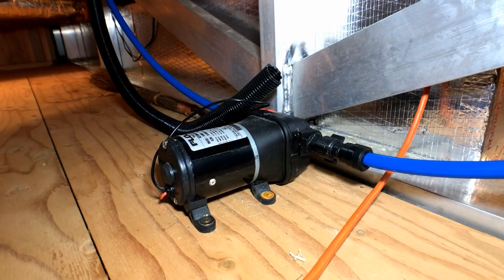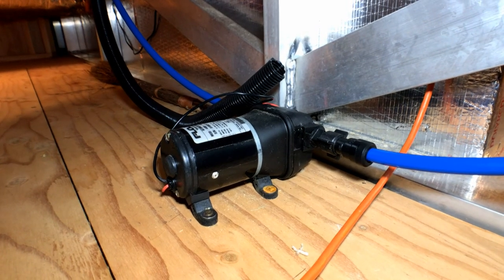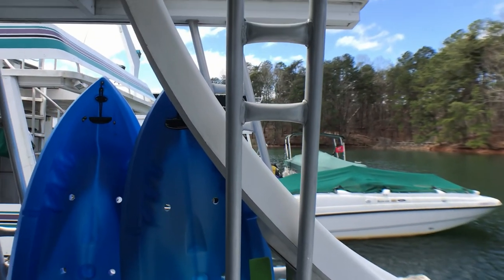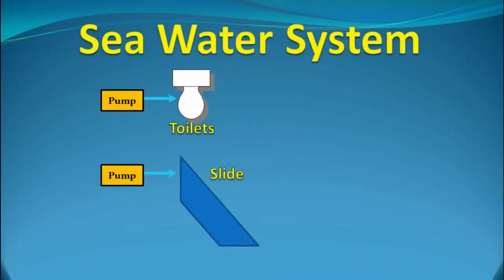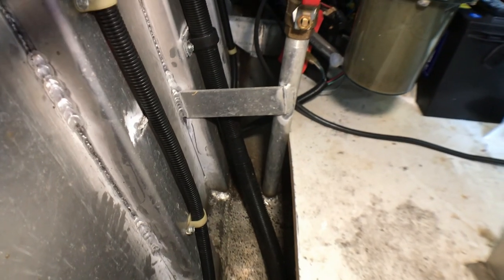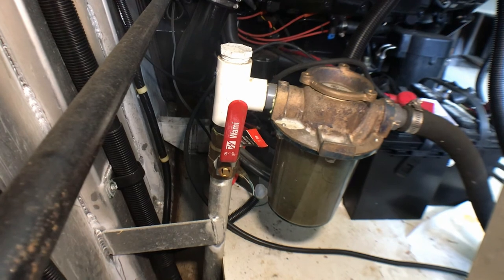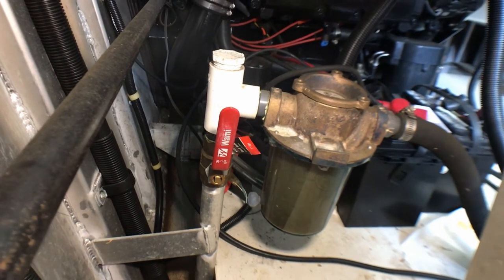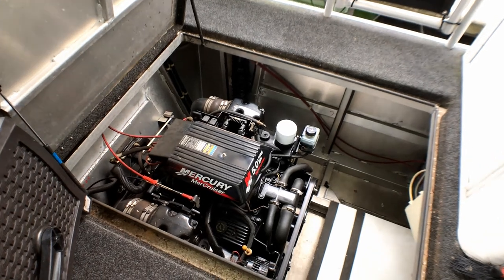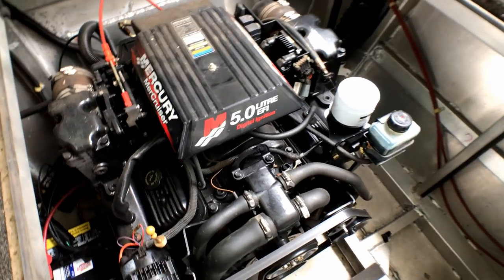The pump for the water slide is located inside the main hull area of our boat — on our previous boat it was in the engine bay next to the through hull. Output from the pump is then piped all the way up to the top of the slide. Each of the main engines and generator also draw water from the lake for cooling. The generator has a through hull supply with a filter, while the main engines have a direct and rather large supply hose coming from the out drive. The engines use built-in water pumps with rubber impellers rather than separate pumps like the toilets and water slide.